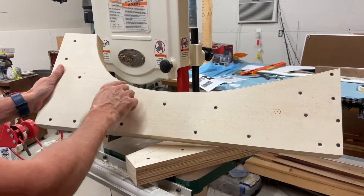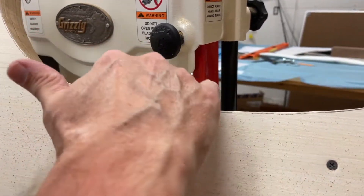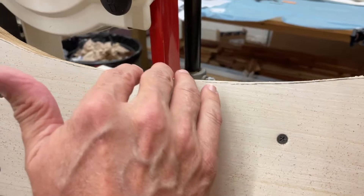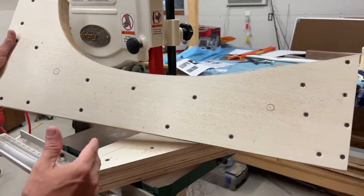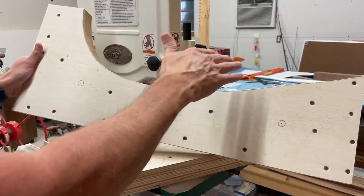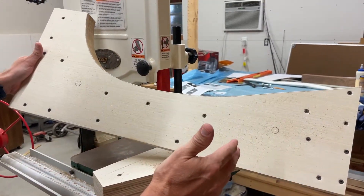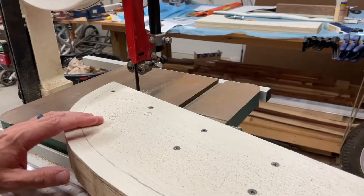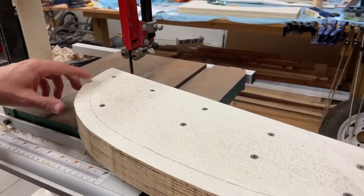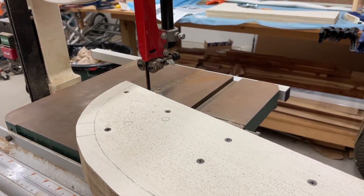On the bottom part of the mold I went really close to the line — maybe touched it a couple times but tried to stay just outside because the band saw blade can wiggle on you and may not give a perfectly smooth 90-degree surface. We're going to clean this up after. I'll use a drum sander, pattern sander, or possibly a router to get a nice smooth edge right to the line.